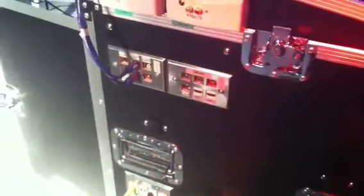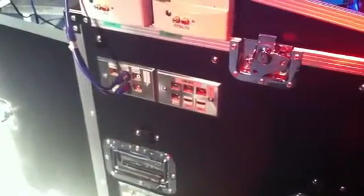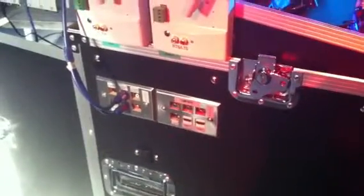And then our next 3 inputs are just audio-only inputs. What we've done is taken our analog input with it not assigned to any video, and that goes through the coax input, so it is converted from analog to digital, so you can do 7.1 with it. And we do the same thing with outside audio 2. It's not assigned with any video, so if you had a device that you didn't want assigned with a video, just an iPod or something simple, allowing you to use some of your video resources a little bit differently, it gives you a little bit of flexibility.